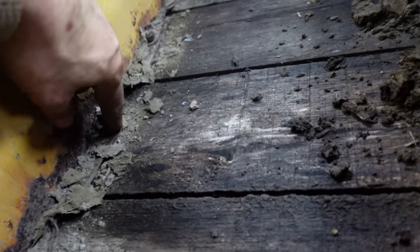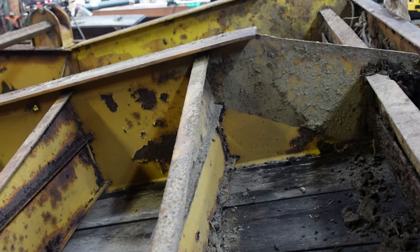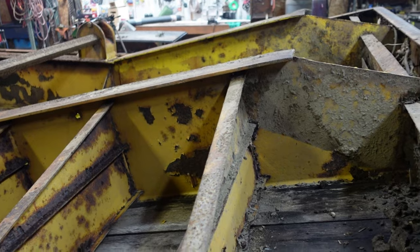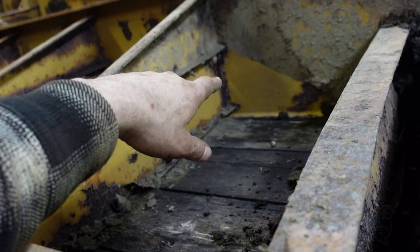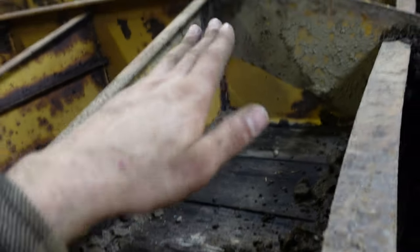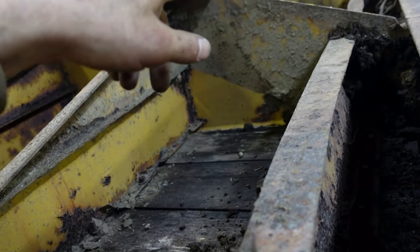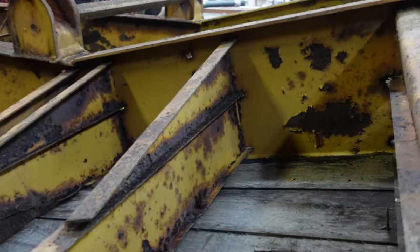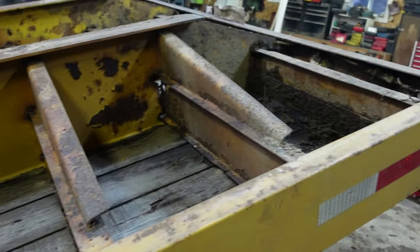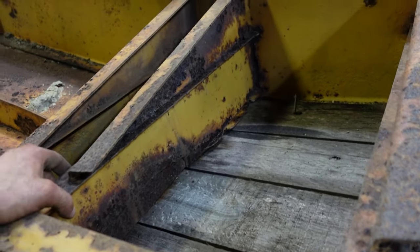since the boards are bolted onto these, the deck boards are gonna come off the tail. And then I've got some galvanized guardrail holding posts. I think since they didn't weld them in the center, they just float through there. I think without the deck boards, I'll be able to angle them up through in two halves and weld them in the center, and I'll have fresh I-beams from one side to the other. I only need to do that in the tail, so that looks like there's one, two, three, four of them. And the front one, I could probably skip.